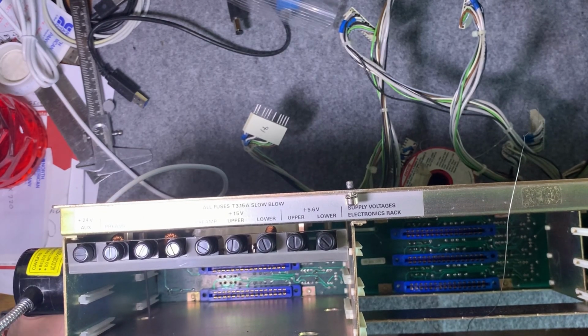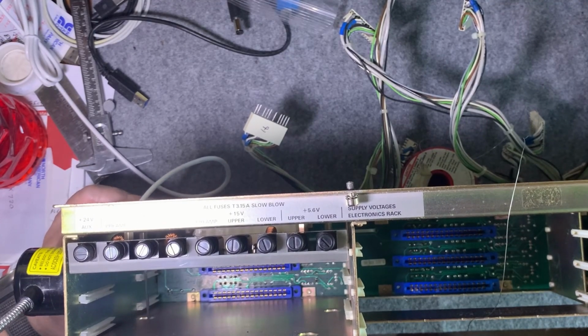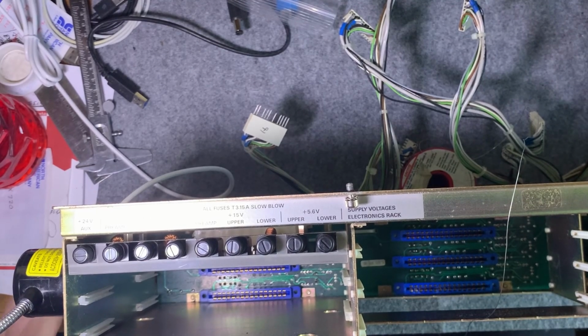This one down here was a little trickier because this one has a star washer to bite into the circuit board and ground it. And that's it. Well, that's a lot of stuff there. Really, we're just talking about soldering and putting things together, but that Dolby section is now done. And in the next video, we'll plug everything together and actually screw it back into the card drawer and close that card drawer. It will be done.